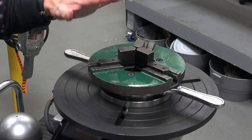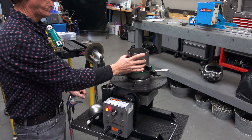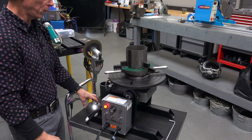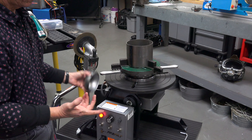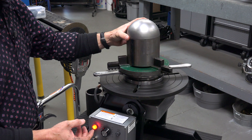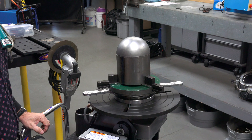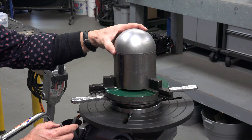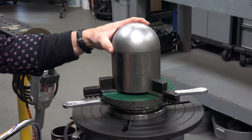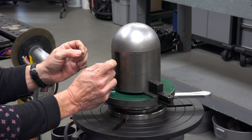The chuck is on the machine. This is a gripper chuck with handles on each side to grip and tighten. I mounted a five-inch piece of steel tubing in here as a good example of an external mount and what you would use a positioner for. This is actually from one of our customers who makes motorcycle oil tanks. This is the primary portion of the tank and this is the end cap — it would get cleaned up, tack welded, and then the operator can just rotate the part and weld.